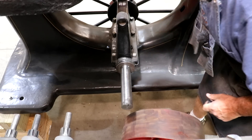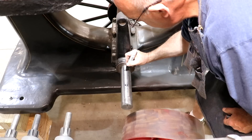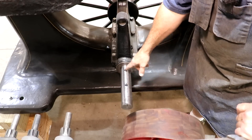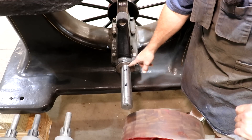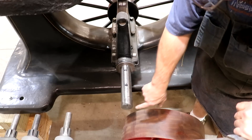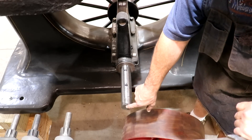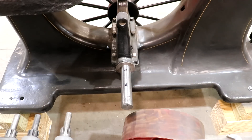I got just what I need here — the two marks I'm looking for. One right here, one right there. So I think what I'm going to do is get a drill and just put a little indention. I did that kind of over here where this set screw went, although we're not going to use that one anymore. It's below the surface. We'll put a couple in there as well and then slide it back on. I also put a mark here on the end of my shaft — that's where I can kind of line those keys up because I won't be able to see these when I put them back on, but I can line those screws in.